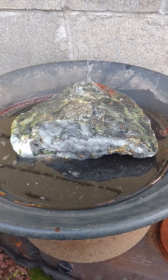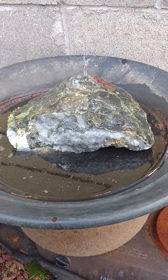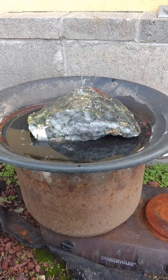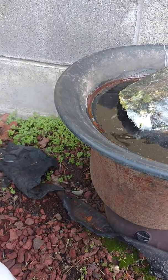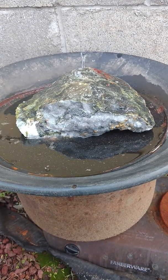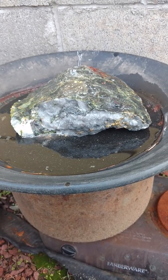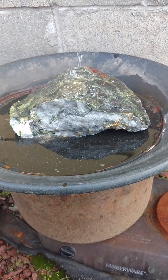I have the specimen in HF now and it's in a gold pan which is acting as a double boiler. You can see some steam coming out from underneath the pan itself. With such a large specimen, heat's definitely going to make a difference in the speed at which the etching takes place.